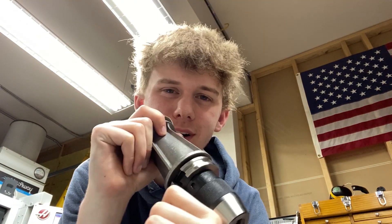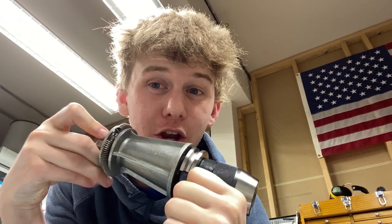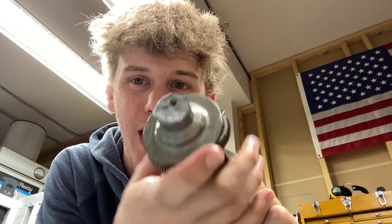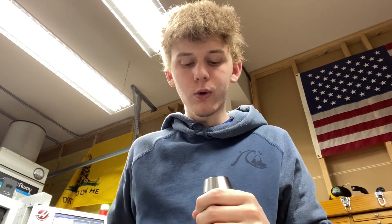This is not a fun thing to tell you guys. I had a little bump on my machine. This is the tool changer pocket — you're not supposed to hold this. You can see the casting there cracked. I have a drill stuck in here. Basically what happened was I needed to drill and tap some half-13 holes in the back of this mold, and I showed you I had a drill sticking out.